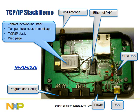Antennas built in. Here's a slightly different reference board that now gives you USB connectivity. Again, very low cost. You can still build it. Modules can plug on and off of this reference design. This one accommodates an external SMA antenna. It still uses the Ethernet PHY, and it has an FTDI USB chip programming port that you can program the devices off of.